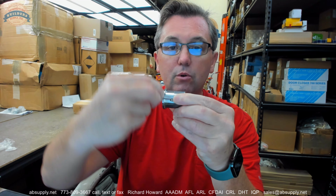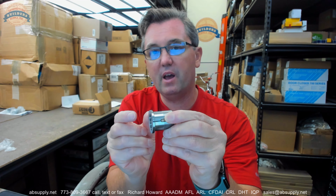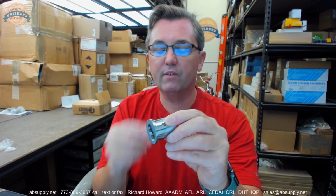So possibly the largest manufacturer of cylinders in North America, in the United States anyway, has said, and there's kind of two parts to this. The operating parameter of the cylinder can't include the head because it bottoms out on the cylinder or trim and is not part of the penetration of the cylinder into the lock. So what this gentleman is saying is, don't include the head. It doesn't come into play, whether it be a weird tapered head or square head, whatever you've got.